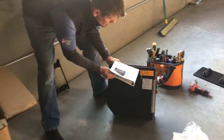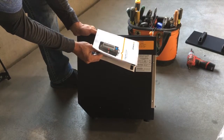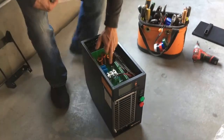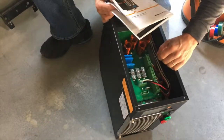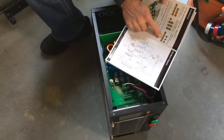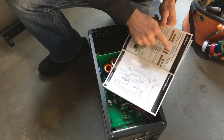The model number you've got to pay attention to is an FS3 MP 330-2. Inside here, there's a configuration you need to pay attention to. When they ship this, it said 480-volt three-phase, and it was in fact wired as three-phase 480-volt. You can also have single-phase or three-phase 208/240.